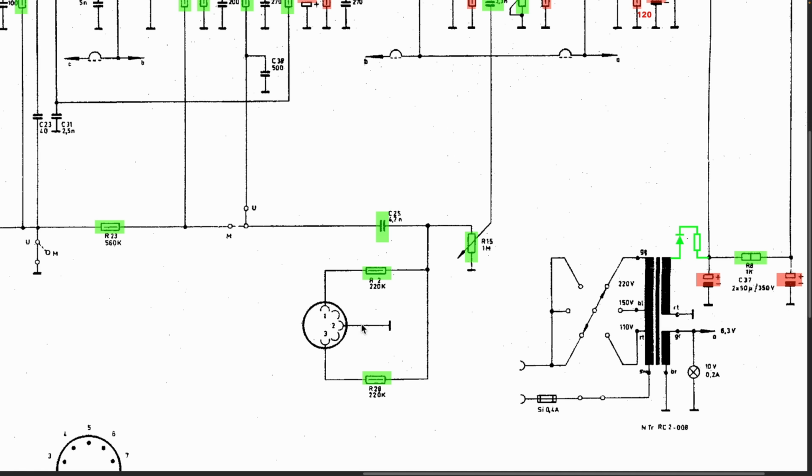So when you want to hear a phono, you move the switch to the middle. It's not even got a click there. It's just between two limits of the switch. Put it in the middle so it doesn't touch anything, and you've got your phono. It's lazy, but it's quite clever and weird. I mean, why didn't they just make this a three-position switch, so that you could select phono?